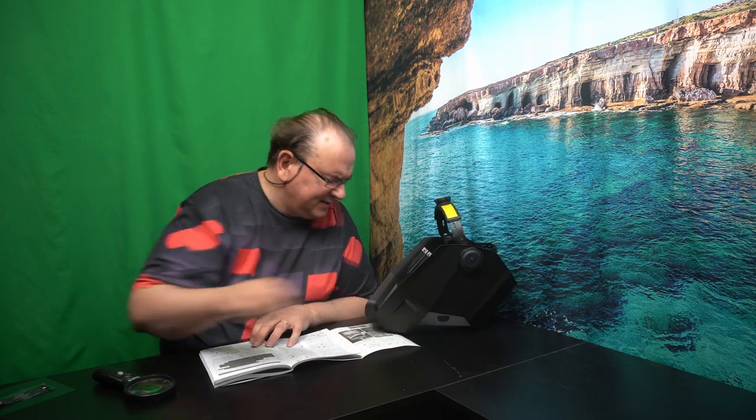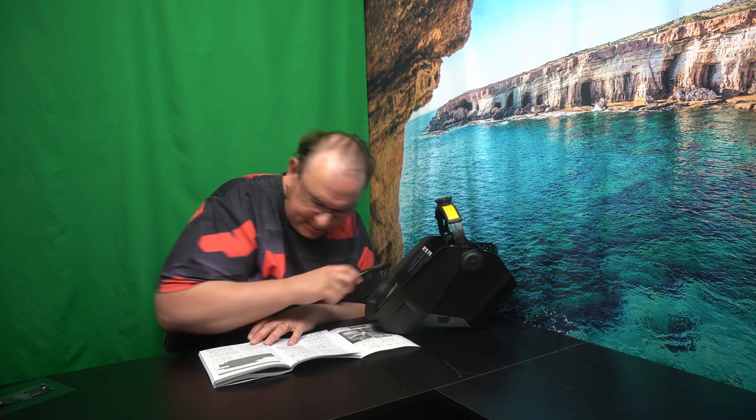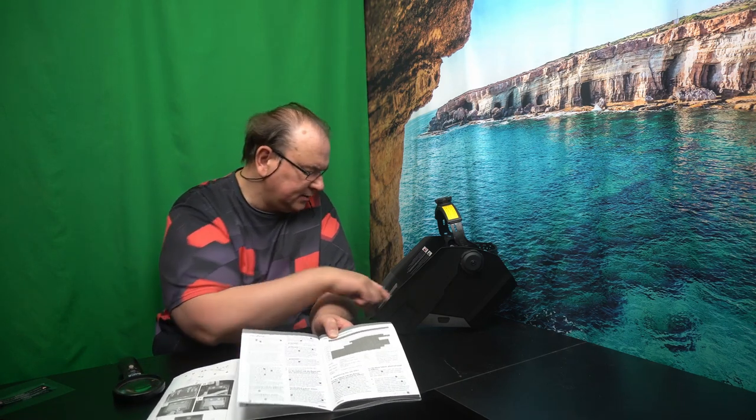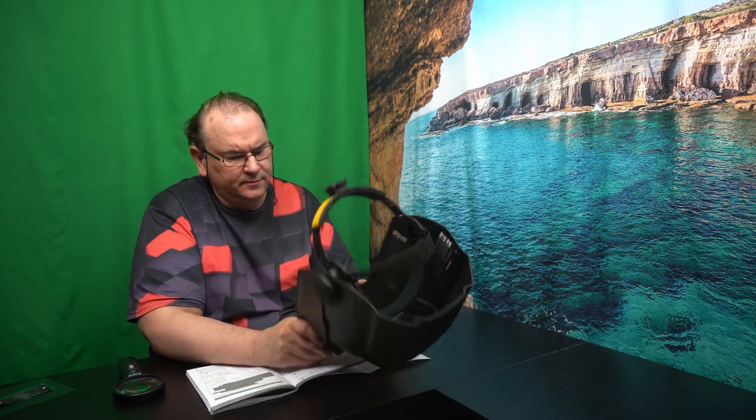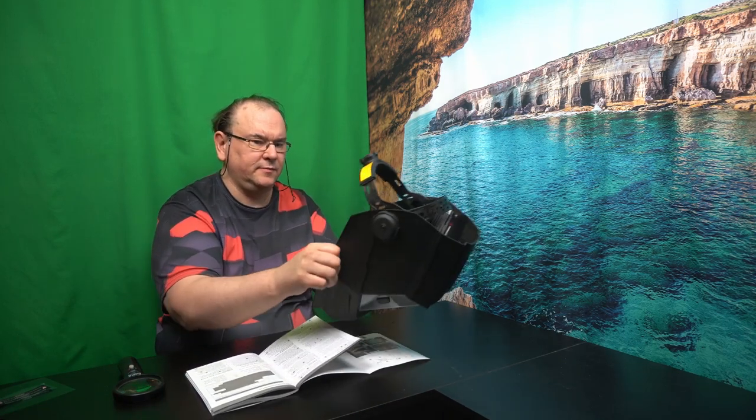There are two shading levels: 9 to 13 or 5 to 8. It doesn't completely match the manual, but I'm assuming the graded area is what you should actually put the shade to. And then based on the amperage rating, you should set the dimming effect accordingly. Pretty much covers the basics — it feels relatively solid. We'll see how it works when we're actually constructing stuff.